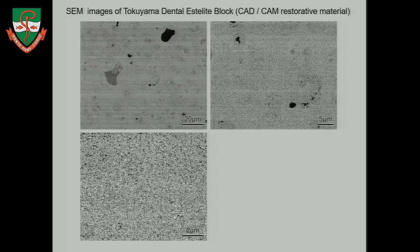And these are SEM composition images of the flat surface processed with a cross-section polisher. At low magnification, the image contrast was more uniform than the observation of the specimen of argon ion etching. However, in the high magnification image, it is easy to observe the spherical fillers. It is necessary to know that the information obtained from the image is different depending on the sample preparation method and observation method.